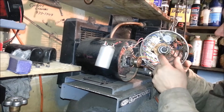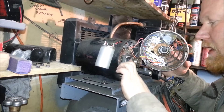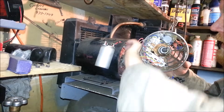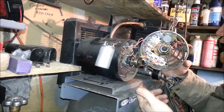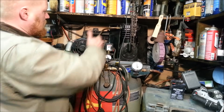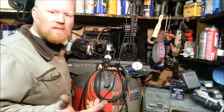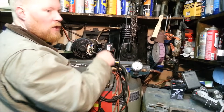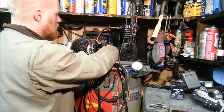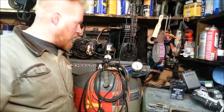These contacts are getting a little worn — they rub directly on the fiber disc so they can actually wear out. It doesn't hurt to apply a little bit of grease to that to lube up the feet. Pretty much I just put it back together and test it. It's still at 80-something PSI so it's not starting from zero — there's still a load on the motor. Let's see if it fires up — yep, no problem.